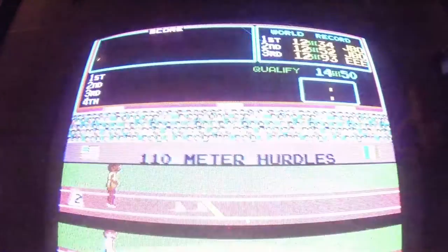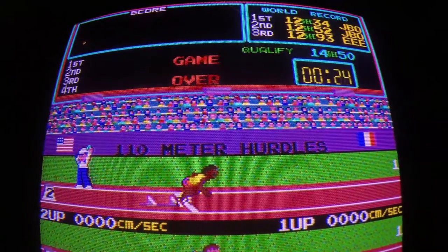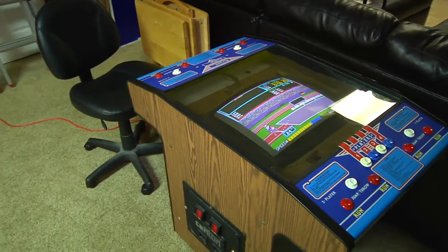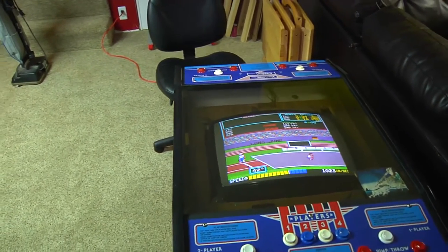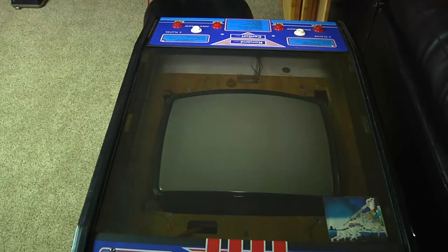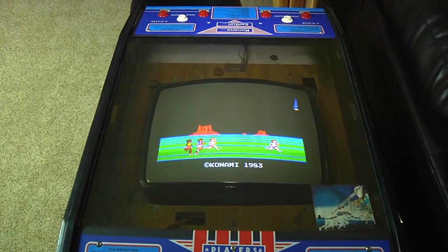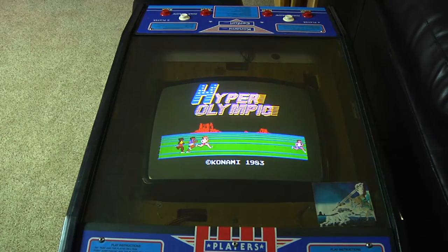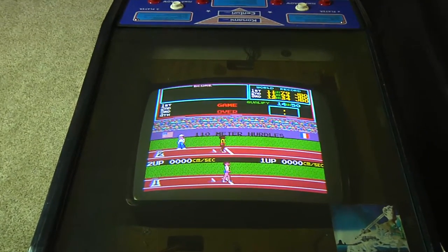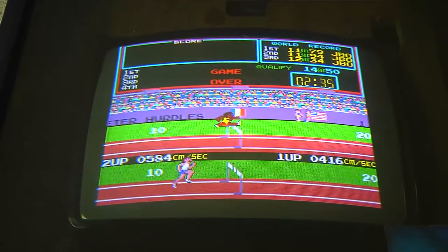Let's take a look at the screen and check that out. So far so good everybody. We have the Track and Field put together — it's a good looking machine. We have done the necessary voltage adjustments to the PCB and we're getting a very clean plus 5 to the PCB. We're getting a very stable image. We also did a couple of adjustments on the board — we were able to reset the high score table with the dip switch settings, powering on and off the machine, and we're able to post some scores on this game. So we've got a fantastic game.